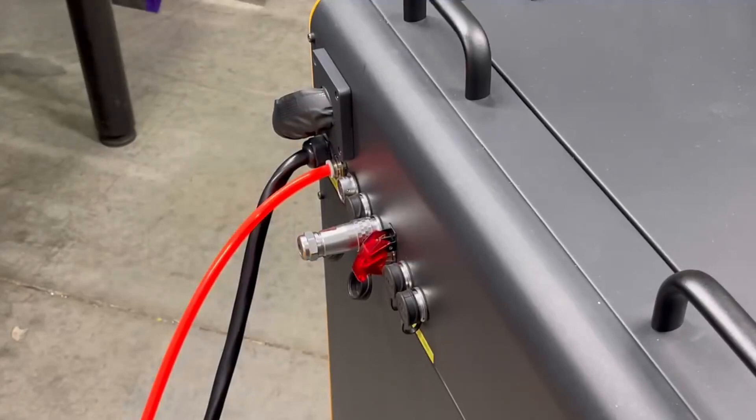On the back of the machine are quick-connect plugs for electrical, gas, safety door, and other things like that. It is worth mentioning that all Denali Weld models are equipped with a quick-connect cobot or robot signal interface and a mode conversion switch. Just connect the cobot/robot signal line and flip the switch upwards, and the machine will automatically switch over into remote mode.